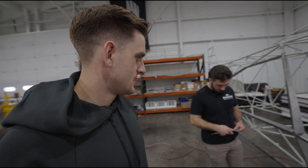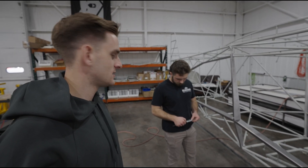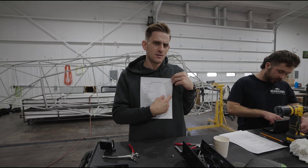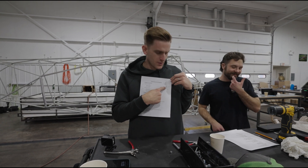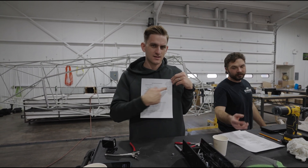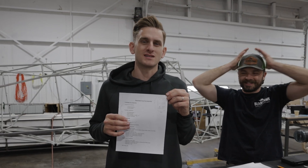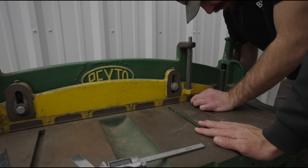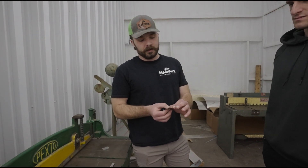When you say fabricate — we're going to build a bracket. Oh, so it's like from scratch scratch? Yep. Create a two inch by one and a quarter inch plate. Then we're gonna put a hole 0.41 inches from each side, and then we're gonna bend it into a V shape. Don't ask me how we're gonna do this, but we're gonna do it and it's gonna look great. Now we're gonna go drill the holes in them before we bend them, just because we can lay it flat on the table.